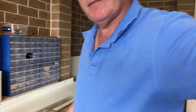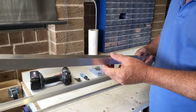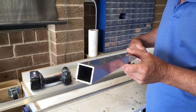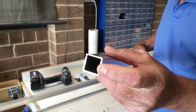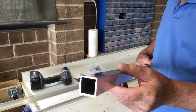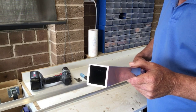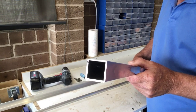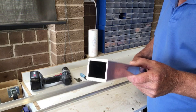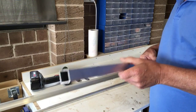So the first thing we're going to do is build the metal frame. The materials you're going to need are over here. We've got some one inch or 25 millimeter aluminum square tube. This is a thickness of 1.6 millimeters — don't go any thinner than that because you need that wall thickness for the strength. I've seen some at the DIY store with 1.2 millimeters, and frankly I weigh just over 200 pounds or 100 kilos and I don't think that would hold me. But I've been making these things out of this for the last 20 years and haven't had one let me down yet.